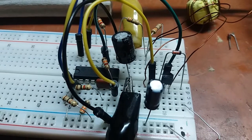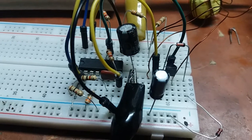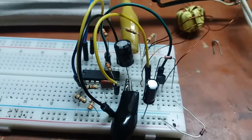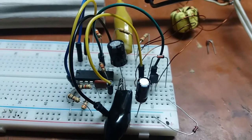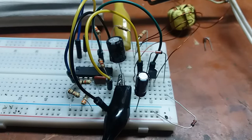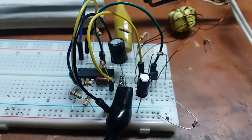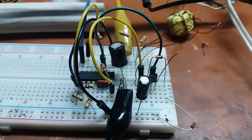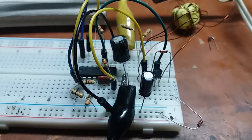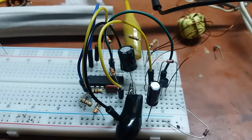The frequency of operation is 40 kilohertz. I purposely picked it reasonably low so hopefully I won't run into extreme trouble laying out a board for it, because the flyback I designed previously runs at 100 kilohertz and that is quite pesky.